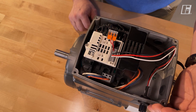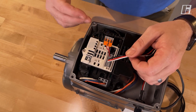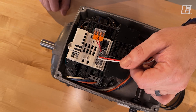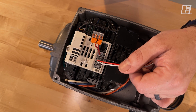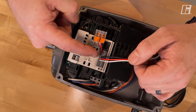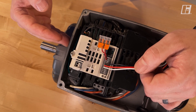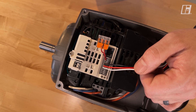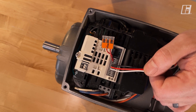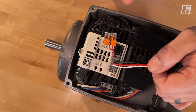If in the field I decided I did not want the dial and just wanted zero to 10 volt, I can simply pull these wires out and plug in my two wires on terminals six and seven to do a zero to 10 volt speed reference. Now if this is ordered in a fan for zero to 10 volt operation, this dial won't be here. What we do from the factory is put a jumper from terminal five to six. Terminal five creates 10 volts; terminal six is looking for a zero to 10 volt input. So from the factory, we give you a motor that is enabled and set up to go full speed. When you have your own zero to 10 — your BMS is installed — simply remove that jumper and land your own wires.